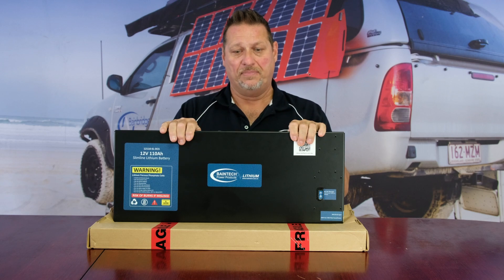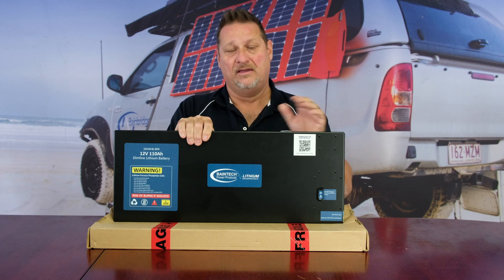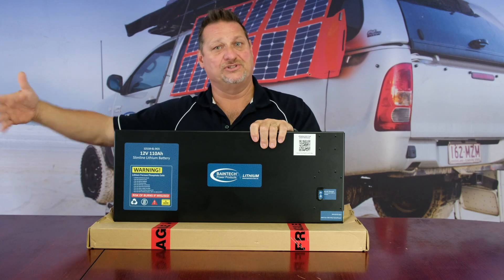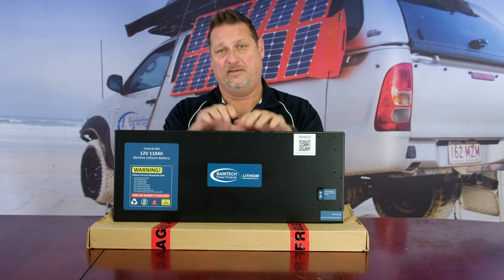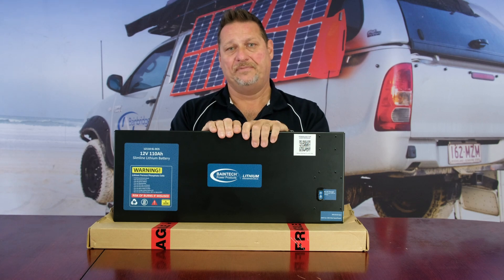That's the job of the thermal protection for over-temperature and under-temperature. Also, as mentioned, there's the circuit breaker for over-current. If you put something on there and the main cable from the battery to your load shorts out, it'll shut down to protect it — so the cable doesn't keep pulling power, going to ground, creating resistance, getting hotter and hotter, and potentially causing a fire. So it'll shut the device down.